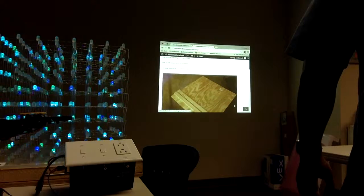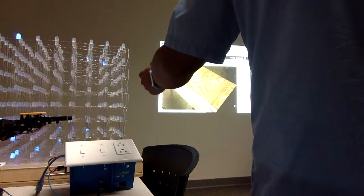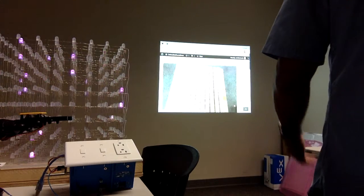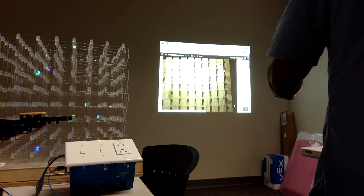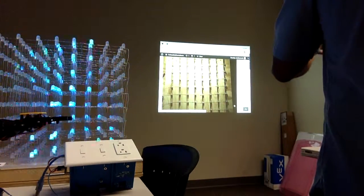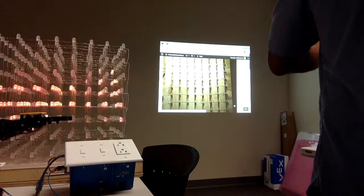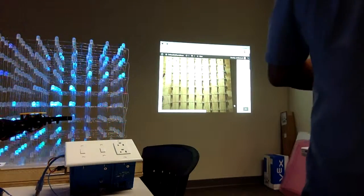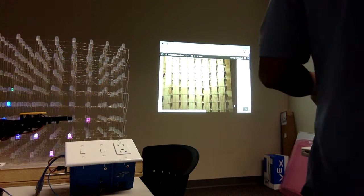So I kind of had to create a frame for that LED. You can't just, doing this, it's still not perfect, but you need a jig. So that's what this is. So Home Depot, some wood, little by little. Wood, and then this is where soldering these LEDs. So you can see there's 8 across, and then you kind of have to connect them. So these RGB LEDs have 4 conductors. There's a common, and then there's the red, green, and blue. So the red, green, and blue are soldered in parallel, and then the other leg is connected to the other column LED.